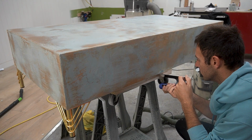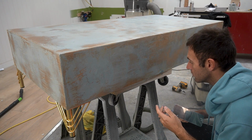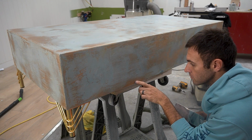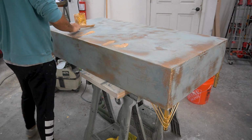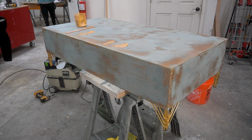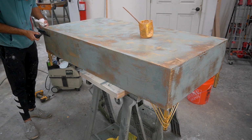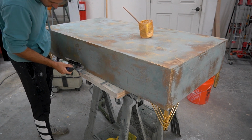Because basically where I sanded away the spray paint, I was left with these black areas that looked just like stained plaster. But I finally had the idea to take a little bit of lacquer thinner and I wiped all of the areas that were stained and it basically made them go away. Now you can still see a little bit of movement from the texture of the plaster there, but basically the stains were gone and I was able to put the gold wax on it.